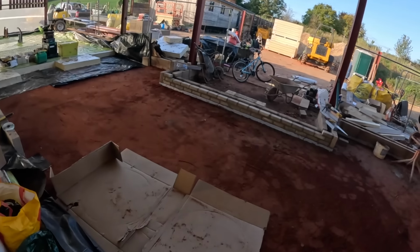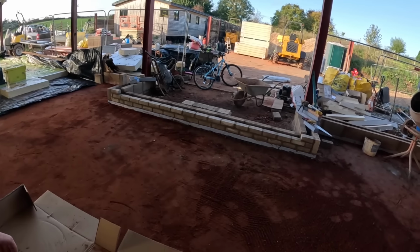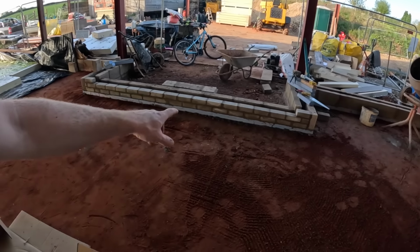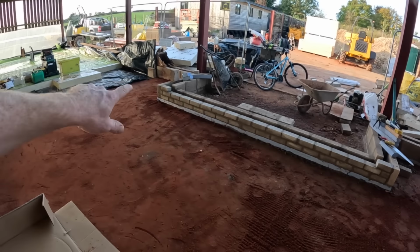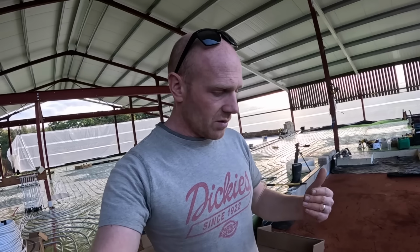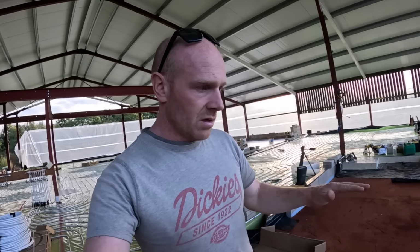door. And isn't it looking smart? So, believe it or not, built some steps, even got a little gravel entrance now. So this is a thermo block at the bottom, two commons. So we're now 75 millimeters below finished floor level. I'll put a block of timber in there on the inner leaf, screed up to that with the slab. So we can then remove that, fit our door in the future, and it should all be hunky-dory.